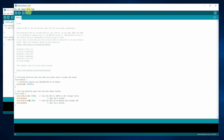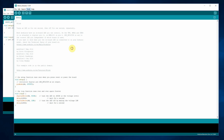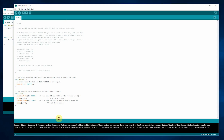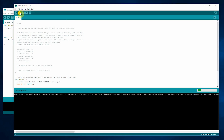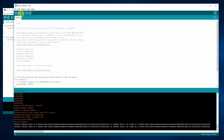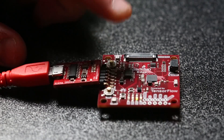With that done, go over to Tools and select the port that your board is connected to — in my case it is COM4. The board with the core installed will show up as SparkFun Edge underneath SparkFun Apollo 3. Click on that and then you can start the upload and compilation process. Make sure that you hold button 14 while it's uploading so your board can be programmed automatically by the Arduino IDE. Once you've finished uploading and you see the done uploading message, just hit the reset button to start blinking the LED.